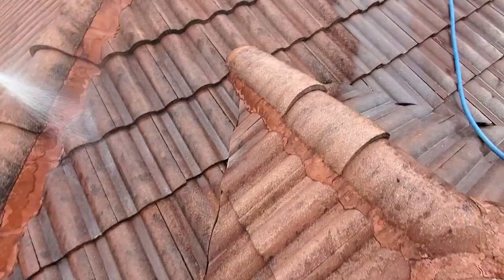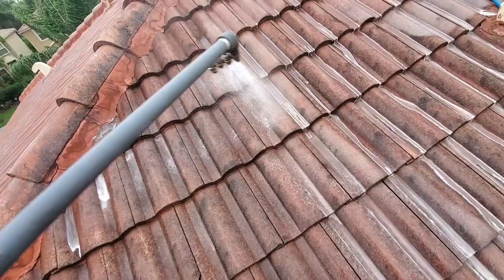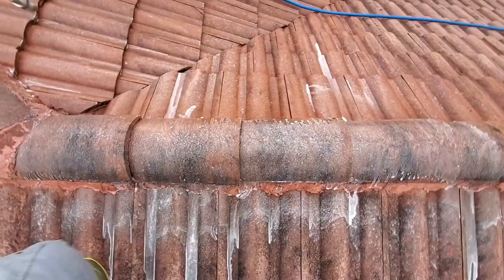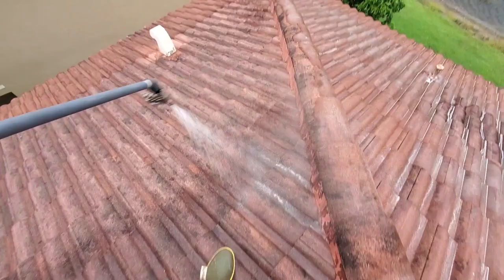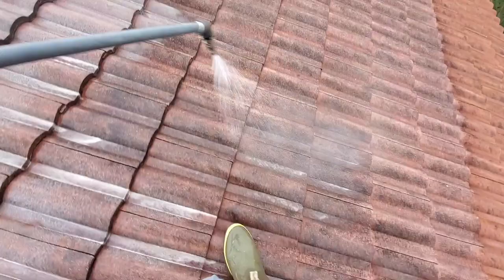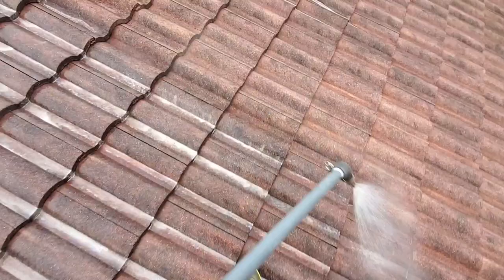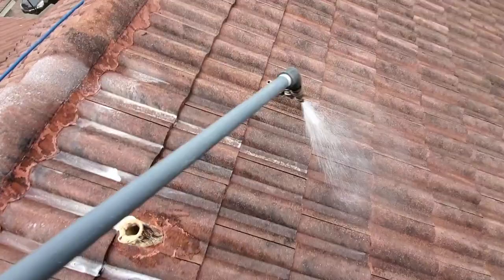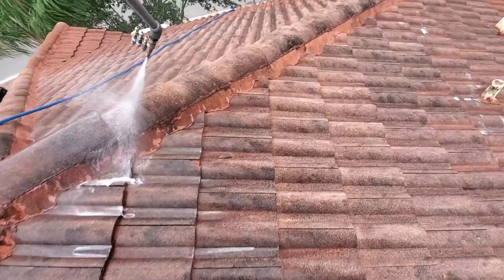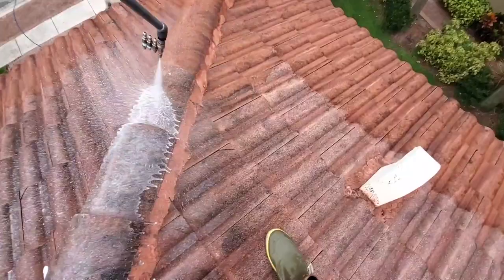I put the before and after picture up on my page — yeah, it was just really dirty. I coated it once and it just wasn't enough, so I had to go back. I probably coated it two, in some areas three times. I had Anthony working with me today — he's down on the bottom rinsing. This is a two-story roof. At this time I'm thinking the rain is going to happen any second; the wind was blowing extremely hard. In the wand I have a 40-degree spray tip and I'm holding it very close to the tiles because of the wind — you can see the spray pattern sometimes just blowing, it was just hard to control.